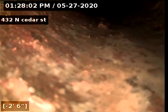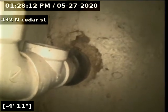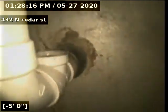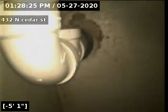Okay, sewer line is in pretty good condition. I didn't see any really big issues at all. I just recommend the sewer line be snaked every 1 to 2 years per Colorado Springs Utilities for preventative maintenance. Strongly recommend cleanouts be installed. Due to a 3-inch cleanout-only access, we can only get a 3-inch cutter, not a 4-inch cutter, down a 4-inch main. Not the proper way to clean it.